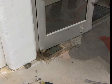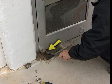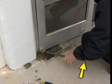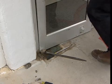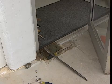With the door closed, place a crowbar over a large screwdriver handle with the tip of the crowbar beneath the knuckle adjacent to the spindle. The screwdriver handle is the fulcrum, and the crowbar acts as a lever. Carefully press down on the crowbar using one foot to lift the arm knuckle off the spindle.